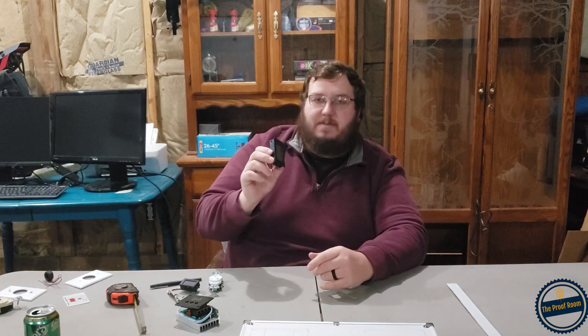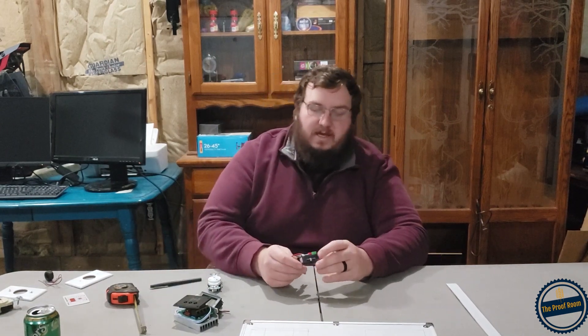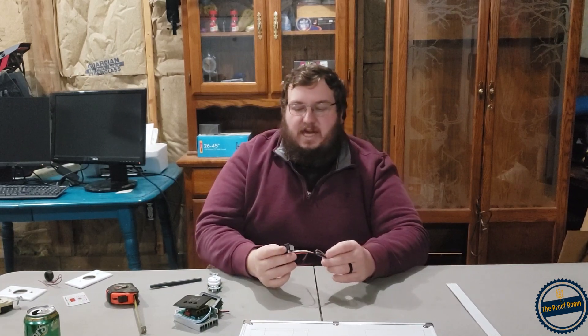This is all for 240 volt. The next thing we have is a volt and amp meter — this is like $7. You don't need this, but it's nice to have a visual reference point. This is a temperature probe that gives you your temperature in your column — just a K-type thermocouple, and it can run on your basic cell phone adapter. In addition to the thermometer with K-type coupler and volt and amp meter and SCR, you're going to need two 30 amp plugs or receptacles and a 30 amp switch to shut this thing on and off.